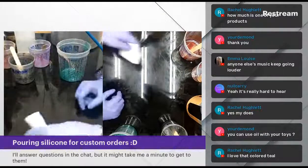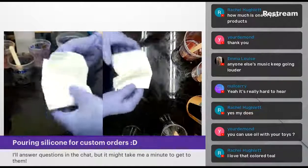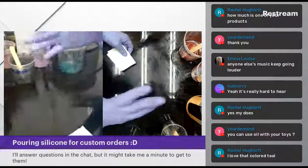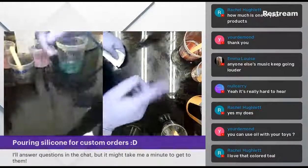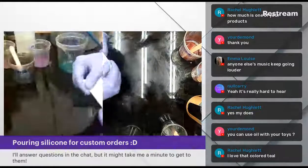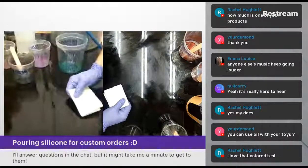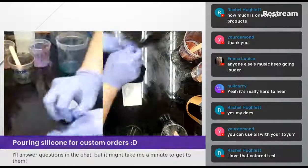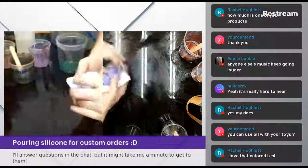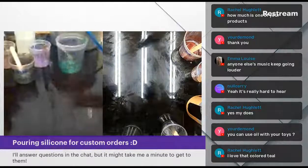Oh yeah, the quick curing resin will definitely throw off a lot of heat. Smooth-On's Onyx Fast, or the 325, doesn't do it as bad, but the Onyx Fast resin from Smooth-On definitely throws off a lot of heat. I do a lot of resin casting with Onyx Fast, and I've temped it up to 220 to 240 degrees. So it throws off a lot of heat.